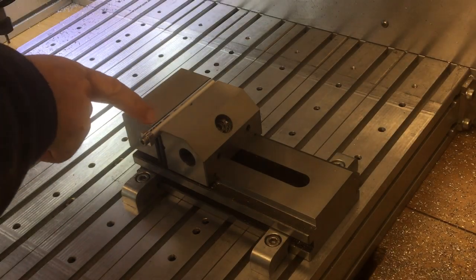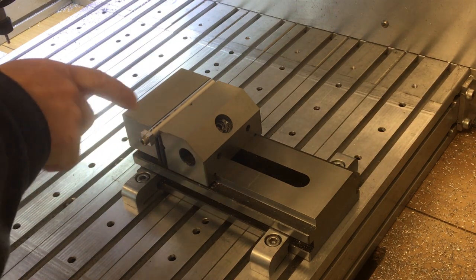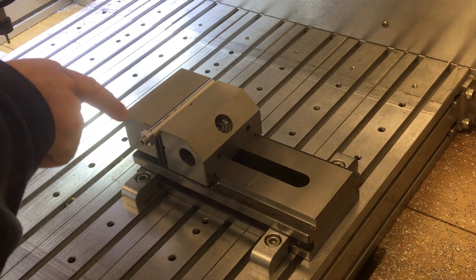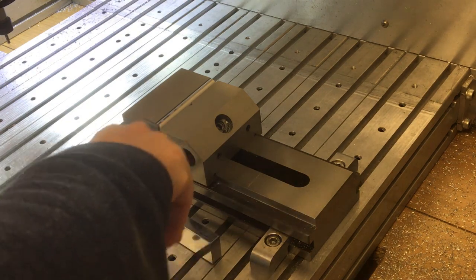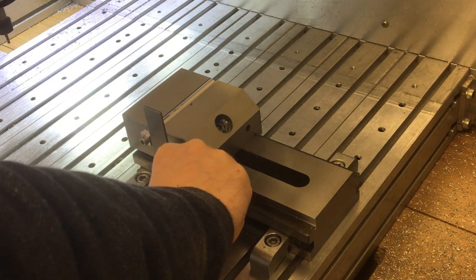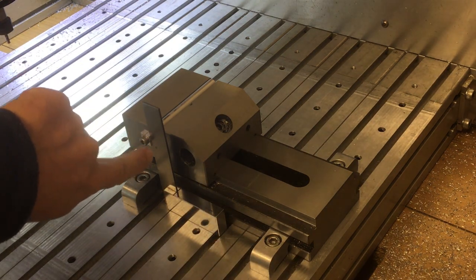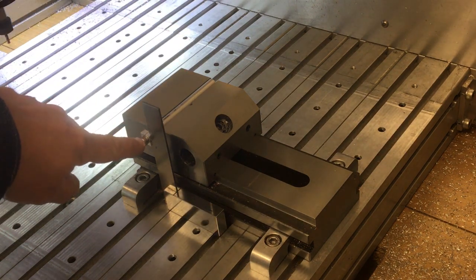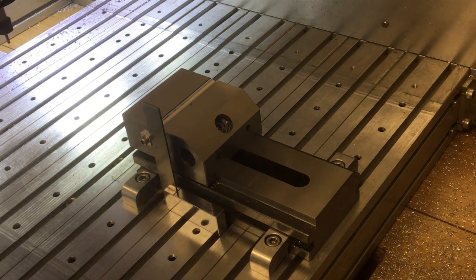Okay, so we've got the bar clamped in the vise there, and here's that little fixture, and I've just marked up where the grooves have got to be, just so I don't make any mistakes. And then I've just got that up on parallels and then used this edge at the back here to square up against. So we now square against that edge, which means that slot's going to be in the correct position. And when we do the other side, we'll index this round and that will tell us the position for the next slot that we need.